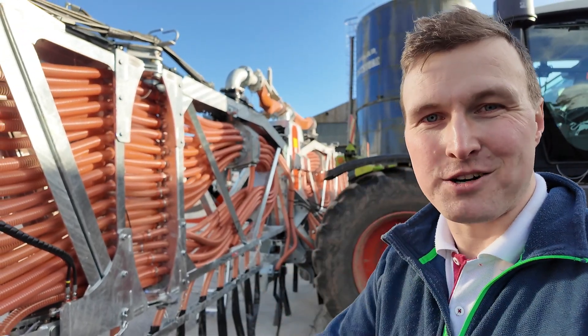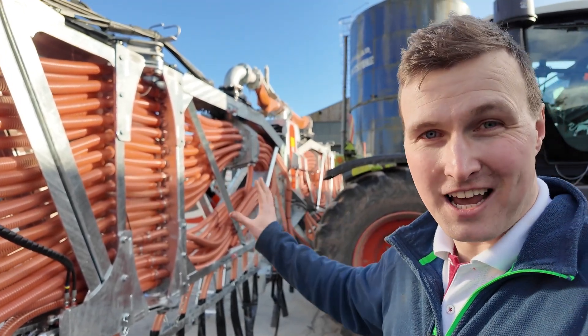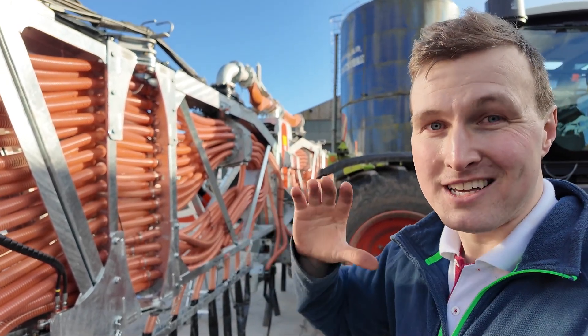The plan for the next hour or so is to put some water through this and test the system for the first time ever — check the flow meters are working, check the control valves are working, and check that we can manipulate the flow successfully.